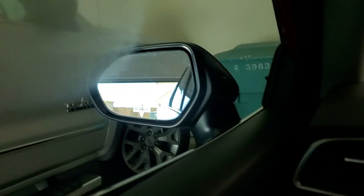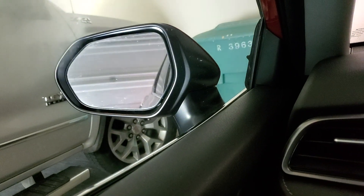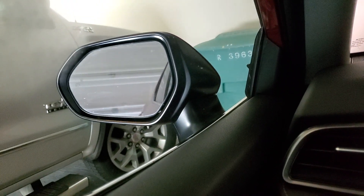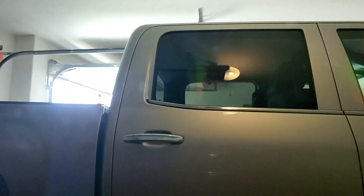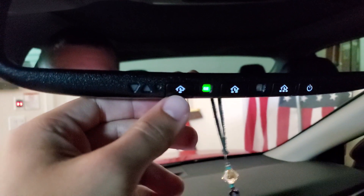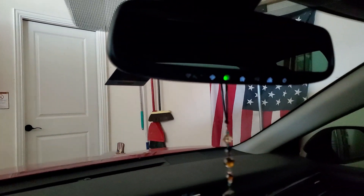Once you program one, you can't control two doors with one, or one door with two controls. I already did it, so that's why it's already working with the middle one. Because I have two garage doors and I needed that one to connect. You have to be really close — I'm right underneath this one, trying to connect it to that one over there, and it won't let it. It's too far out of range. But that's pretty much the gist of how it works.